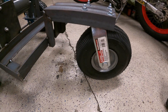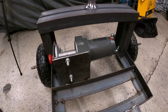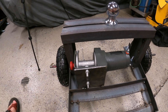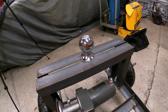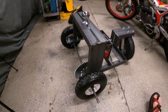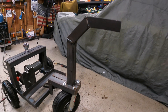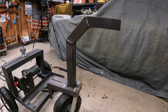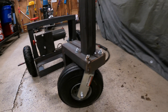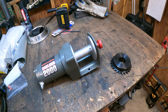On to the next step. We actually had to make a new front gooseneck part for the wheel because when you swiveled it, it didn't go all the way around — which now it does. I've also started the winch mount, just a piece of flat plate so we can drive straight down to that sprocket. We'll gusset this and still have access to the freewheel. I've also made the bridge for the ball hitch — it's just loosely in here, probably needs some brace work, but it rolls under its own power now. We also have a steering arm — just took some scrap two-inch square, brought it up to 90 degrees, and it's perfectly at standing height. Everything is just tacked at this point to make sure it all works right, and then we'll take it back apart. Next, we're going to start tackling those drive sprockets.